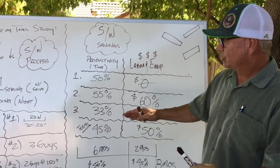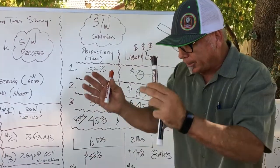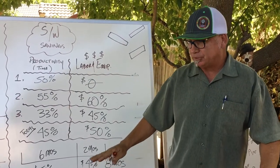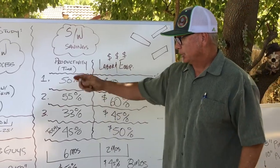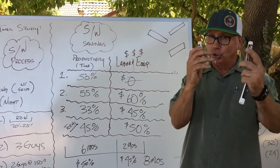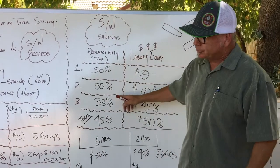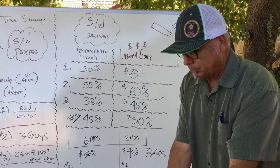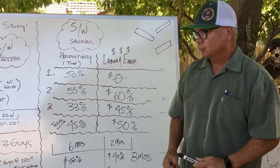That is phenomenal. The load, stage, and string is critical — not a bunch of handoffs, that's not even part of the equation. You've got a streamlined machine that's going to drive, drop, weld — drive, drop, weld — continuously. It is very simplistic, very easy to load, no hangups. It's eight feet wide, you don't need a bunch of right-of-way. Number three — welding. Normal process: 100 inches. String weld machine with just two guys: 150 inches. It's got two welding machines, your water buffalo, your gearbox, your motor, and your toolbox for consumables and tools.